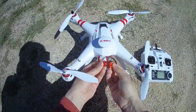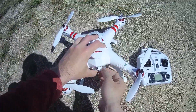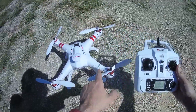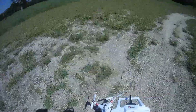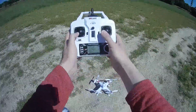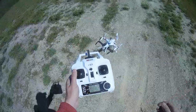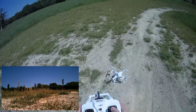So, as I said, as soon as you connect the battery, the ESCs will be turned on. Oh, sorry, because I turned on also this. Okay, so turn on the FC. Turn on the radio, you will see solid LEDs, okay, and it's armed. I strongly advise to calibrate the gyros, as well as the headless mode. For that, you push both sticks to lower left for the headless, you have slow flashing LEDs on the quadcopter, and the accelerometer and gyros by lower right. Okay, we start with the provided 720p camera, start recording, arm the quadcopter, and let's go.